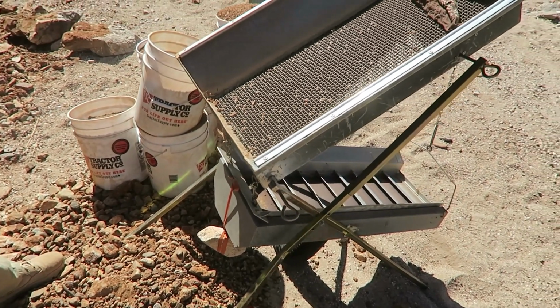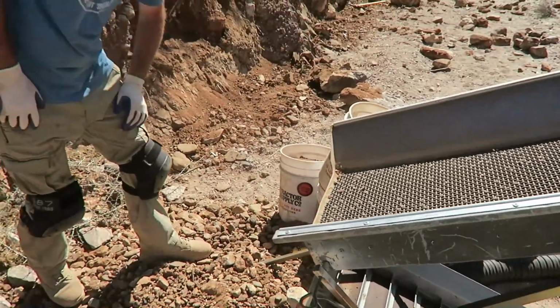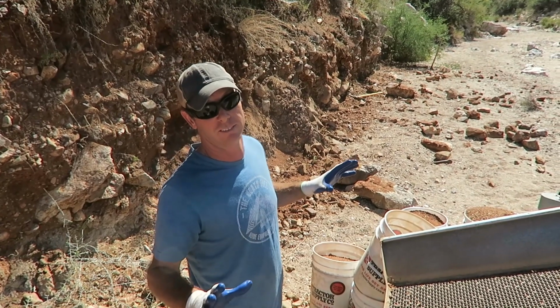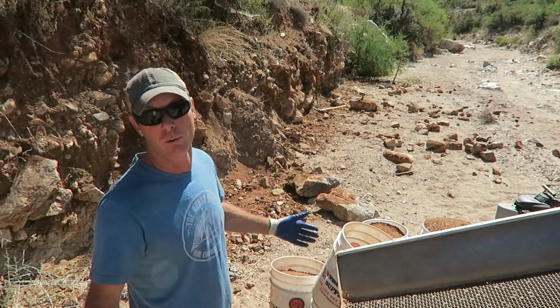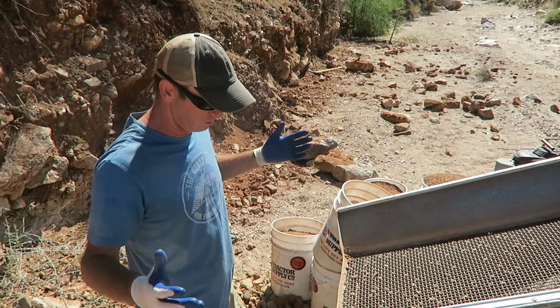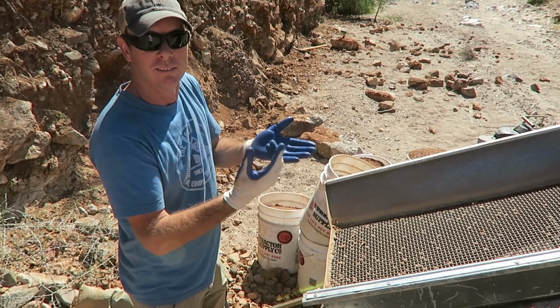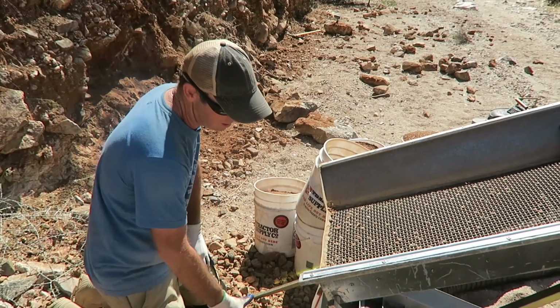One thing about these dry washers is you guys are always running way too much air. When I say too much air, we're not running hot air balloons or filling up balloons. All you gotta do is lift it and let the fan spin. Lift, let it spin, and it will move. It doesn't take very much air.